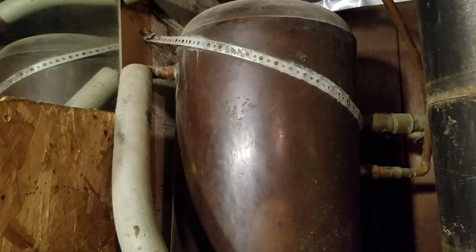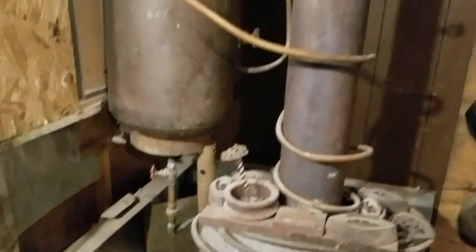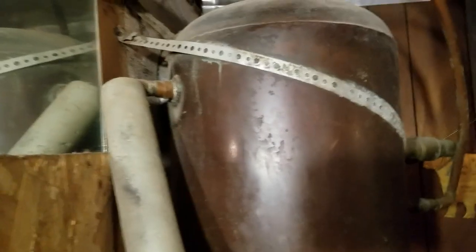As I explained the other night in the previous video, that is a 35-gallon copper tank — not sure what it came from, just an antique copper tank. The way it's hooked up is there's a coil of copper tubing that wraps around the top half of the stove, goes right up the chimney, and then goes up to the high fitting on that tank. The bottom part is connected to a fitting coming out of the bottom of the tank and goes around the bottom of the stove.